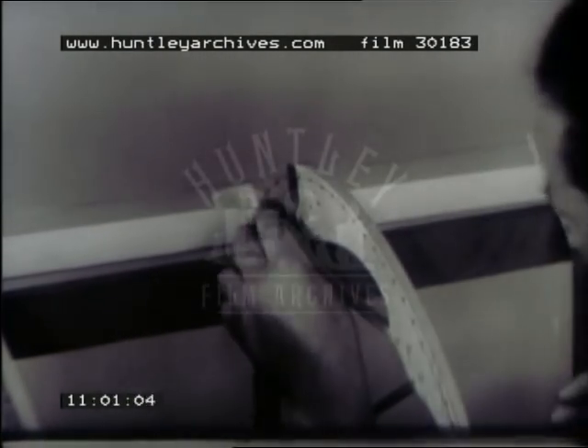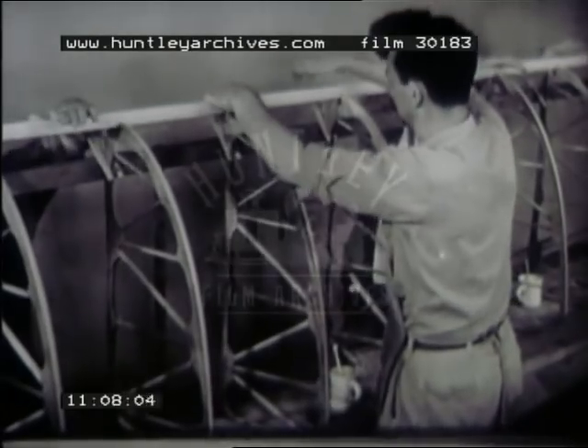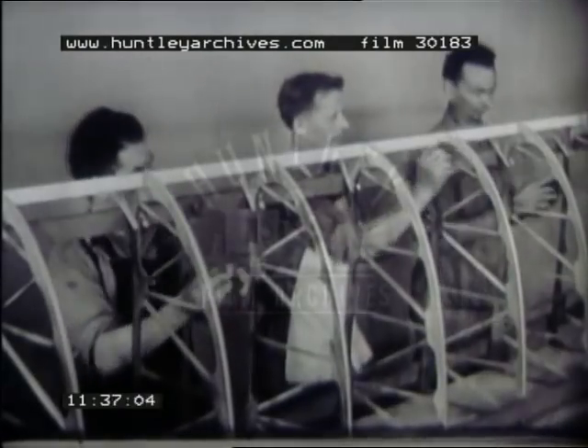Make sure that glue is applied to the entire surface of each notch, then wipe off the surplus. When making this fit, be careful to work it into all of the notches at the same time. Use a wood block to tap it in and to prevent damage to the strip. Again wipe off the excess glue that is squeezed out.